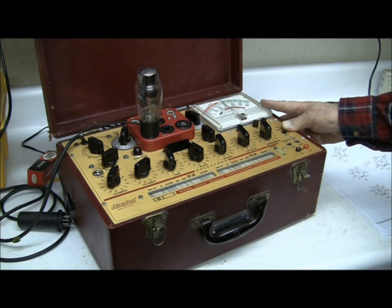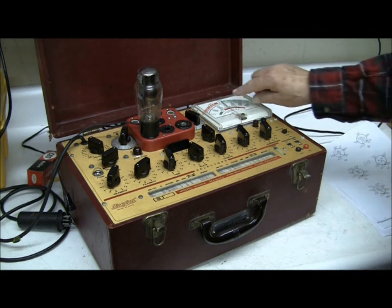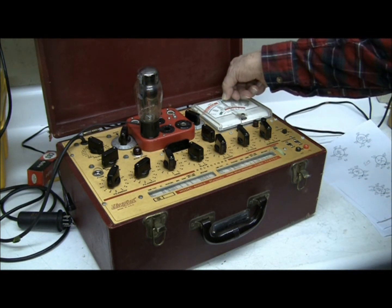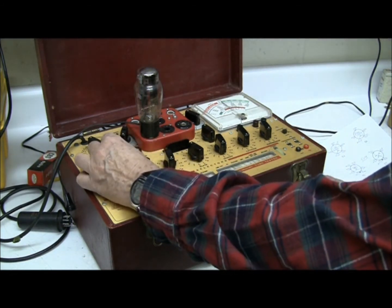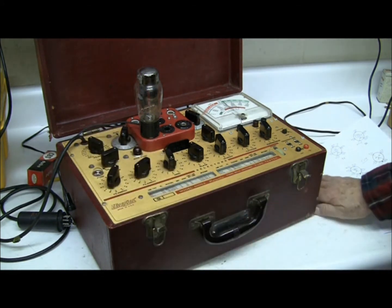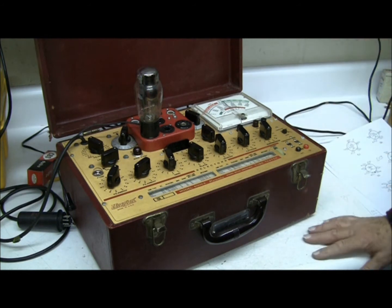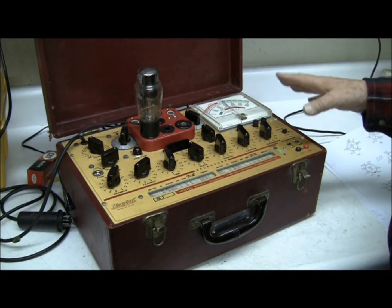Over here on the right there is a meter, and I have set the meter. It's moved just a little bit from what I had it set before, but you have to make sure that the dial is aimed at that little line up there that says 'line test.' I'm going to just jack it up just a bit, because with the tube running and the tester having been on for a while, the parameters change a little bit — the current and voltages shift. So you have to reset that.